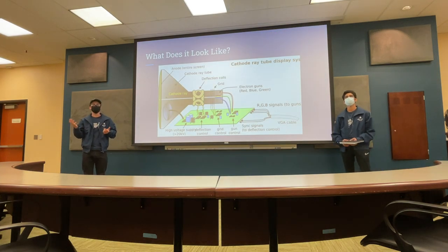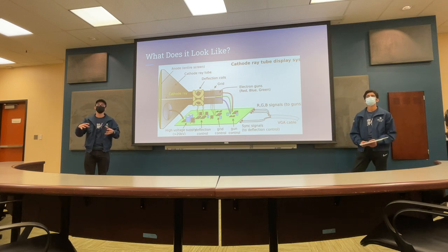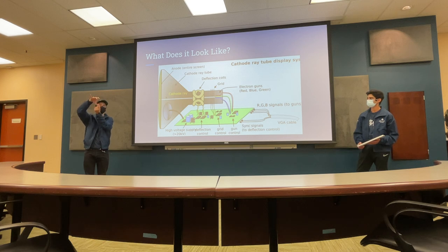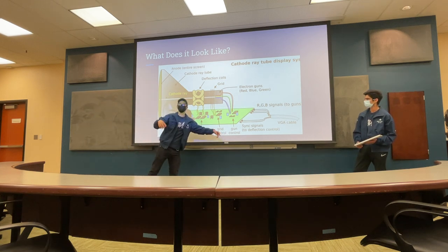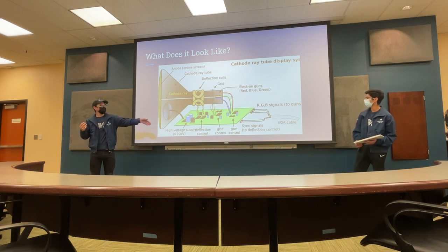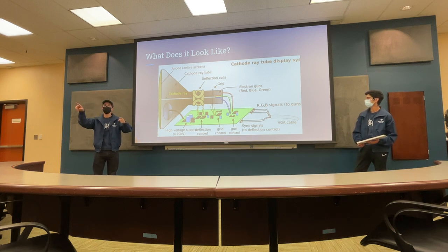This is what the VGA looks like back in the olden days with those old-fashioned CRT display monitors. You can see there are deflection coils, which are essentially two sets of electromagnets powered at different voltages that manage where the beam is located on the screen. There's also a gun control that pulses the cathode ray at a certain frequency — 25.2 megahertz. Then there are the RGB signals and your sync signals, which control where it should be returning back to the start, for your next row or for your next full display.